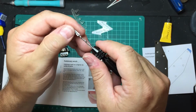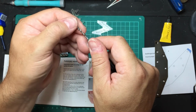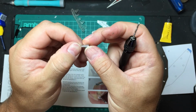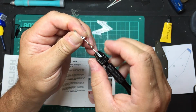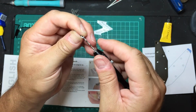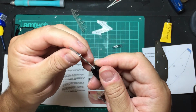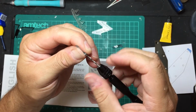If you ever get your drill stuck and it doesn't want to turn, don't force it, because it will then rip through, and that's where it's going to rip through when you don't know what it's doing. That's actually just swarf there, it's not actually the hole. So what you do is, instead of ripping it through, spin it backwards and put the pressure on, and that will just take off that nice little bit that it needs. So there you go, we need to widen this hole. Spin it backwards just to clean the hole and give it the turn forward.